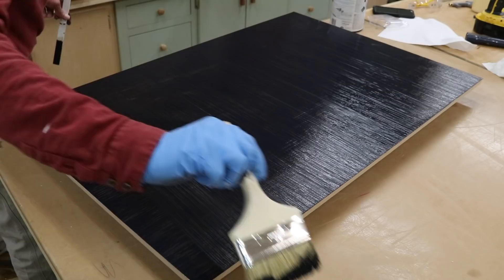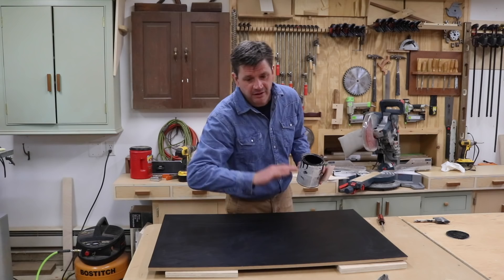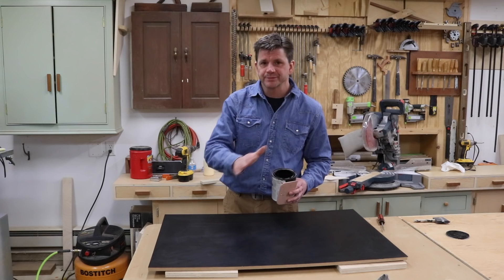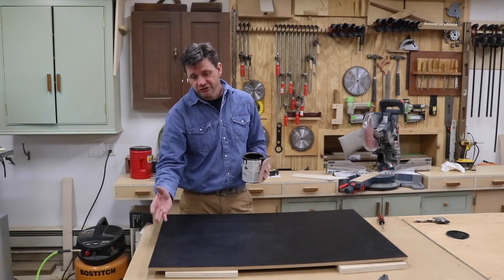For the surface of the chalkboard I'm using chalkboard paint, and I like to use two coats — first going basically in one direction and then the next direction. I sand in between each coat, just lightly sand. And once that's dry then I use a bondo spreader — you can get these at any home store or hardware store — and I'm applying the paint as if you would be applying spackle or plaster. This doesn't give you an absolutely perfect smooth finish, but I think it gives you a smoother finish than having brush marks or roller marks, and it gives you a finish that resembles slate or stone.